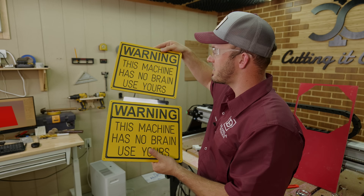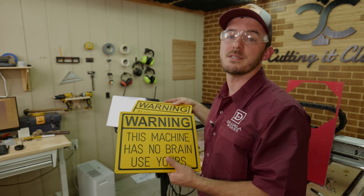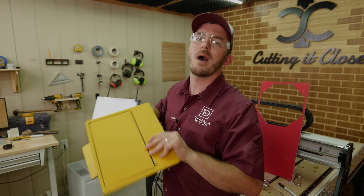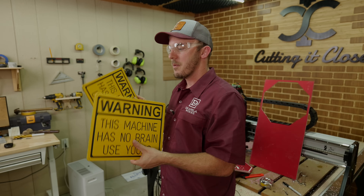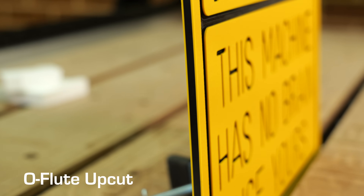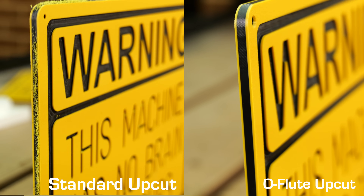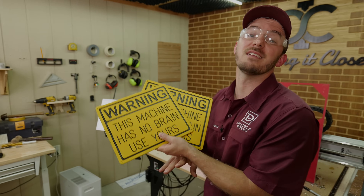You may not see a huge difference in these, and if you're only cutting out a couple of signs like I just did, using that two-flute upcut finisher is just fine — you do not have to go out and buy specific bits just to cut these out. But there is a lot more cleanup work on the finishing side; it leaves a lot more fuzzies, and on soft plastic it doesn't leave as clean a cut as the O-flute, and on hard plastic it's horrible.